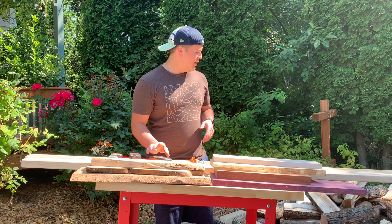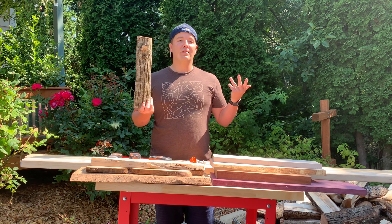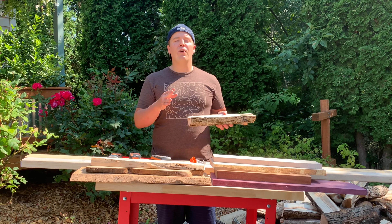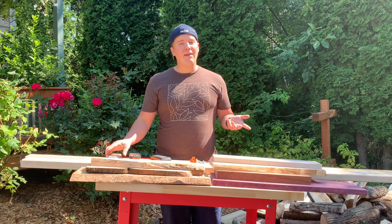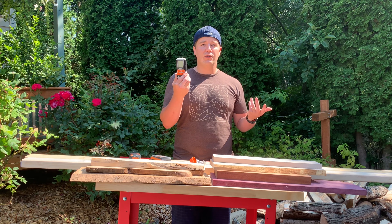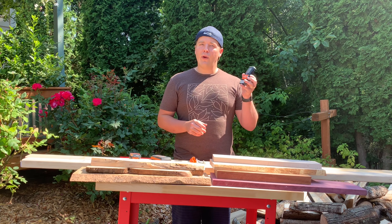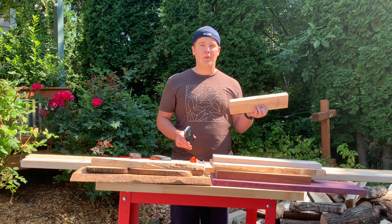Another use is firewood — especially if you're heating your home with wood, it's a great idea to test how dry it is and verify you actually got the seasoned wood you paid for. There are lots of variables but it's a great tool in that regard. This particular unit is one of their new ones they sent me — around 20 to 30 dollars. It has the prongs and the sensor, and it also works for drywall, so if you think you have a leak in your house you can test that too.